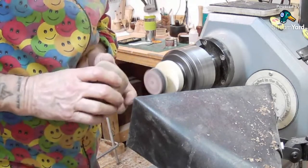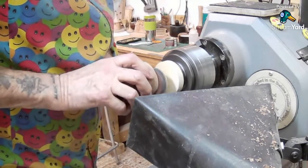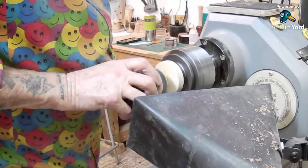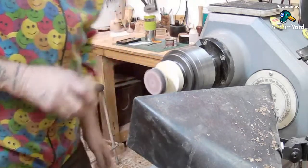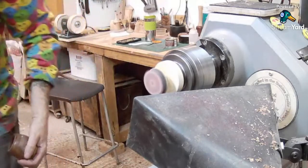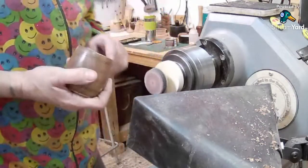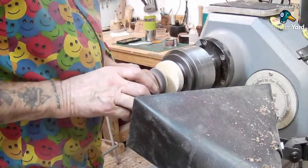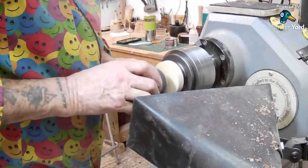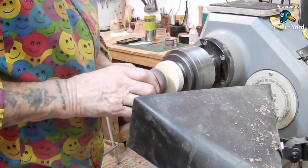So someone asked a question. Hang on, what was the question? Oh yeah, how fast does Brian turn when he's applying the sanding paste? About 500 for the first three minutes or so, and then once you find the grit has done its work, turn the speed up to about 1,000 and just burnish it off then, because you kind of feel it, don't you?